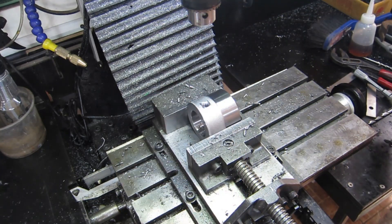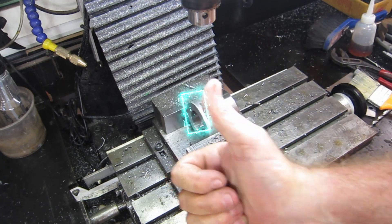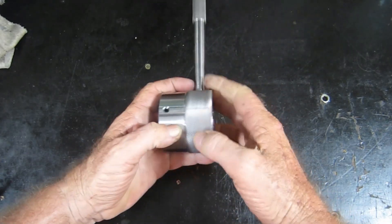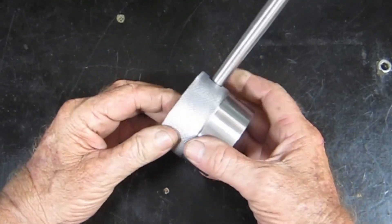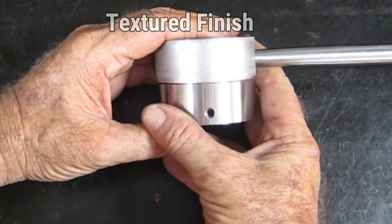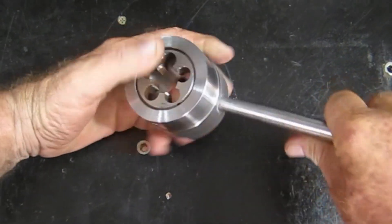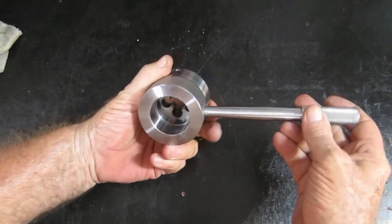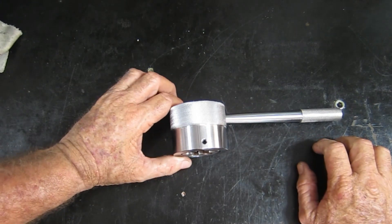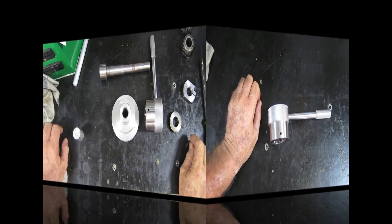That's just a little bit of deburring - that part's done. So that handle will fit in there. Well, that's come up pretty well, if I may say so myself. This knurl - I've decided it's such a poor excuse for a knurl that I'm not going to call it a knurl, I'm going to call it a textured finish. I actually didn't quite get everything out of that face, but it doesn't matter. So next cab off the rank will be to get that spindle out of the mill and put a thread on it with this thing.